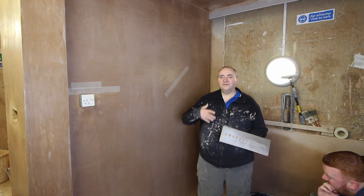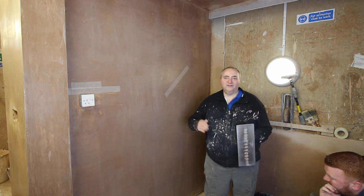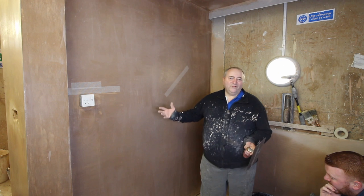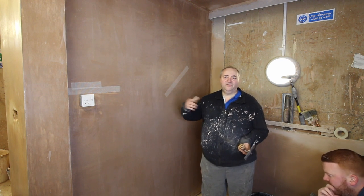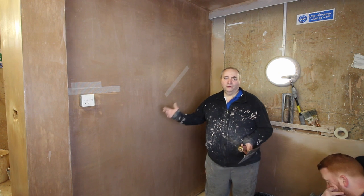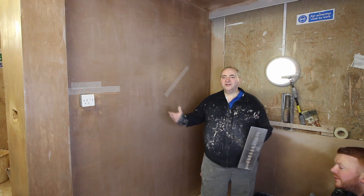It depends on the temperature in the house, wherever you are, it can take 3-4 hours, it could take overnight. I prefer myself PVA the night before, good thick coat, and then plaster it the next day. Doing it the same day, you can risk it sliding.